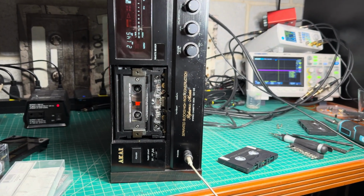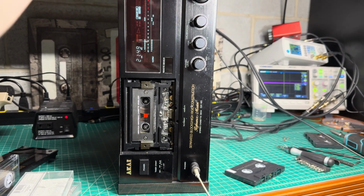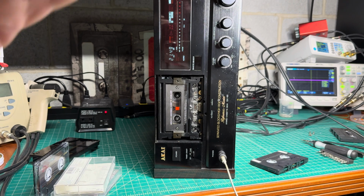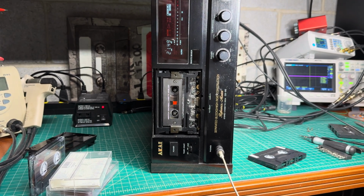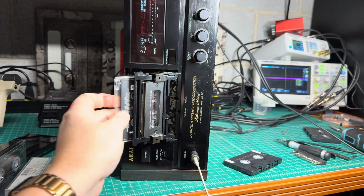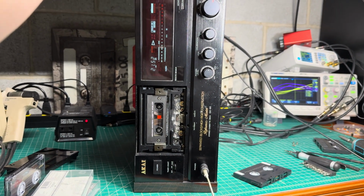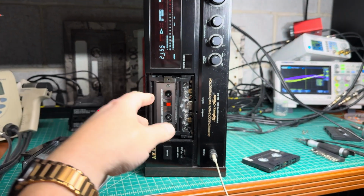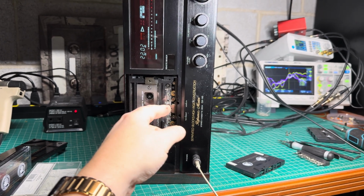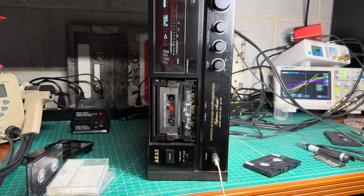All right, now with Dolby B it plays factory tapes perfectly well. I recorded on this deck, then tested on my other decks, and recording levels and high frequency, everything is there. Just to make sure, testing from both sides, testing that the tape doesn't slip to the side, many times. And I did another test to see that the tilt is correct, so there is no gap when I put a proper light there and so on. Lots of work,